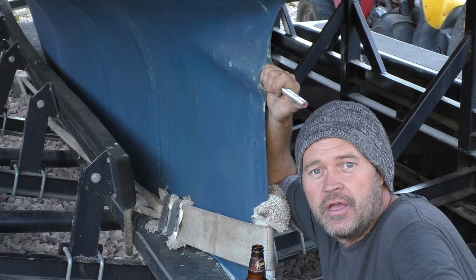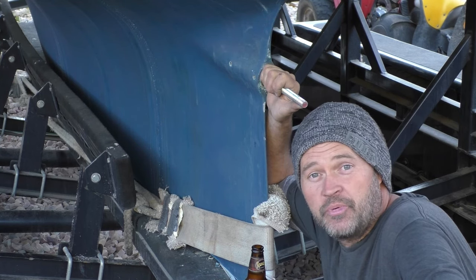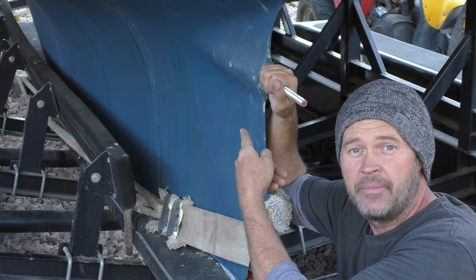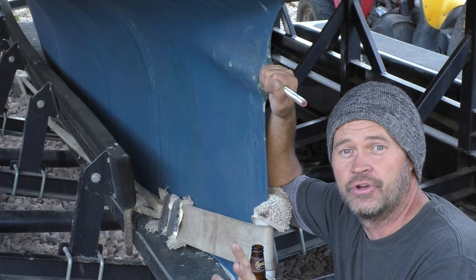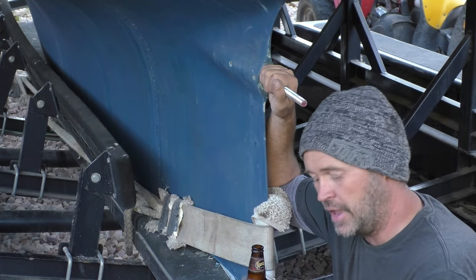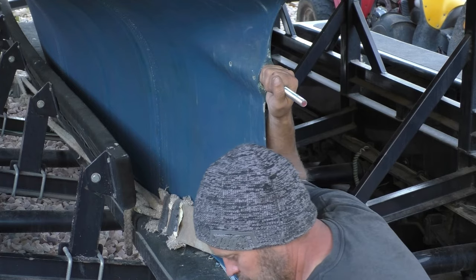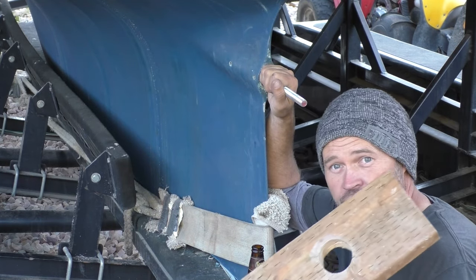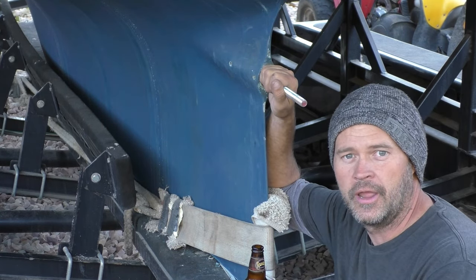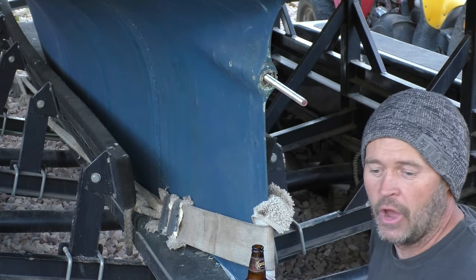So this is what I've come up with next — I'm going to build a press. I've got this piece of all-thread on a pipe; it goes through the sides of the bearing, clear through the stern tube. Some washers on the end — I'm going to try to press this thing out, pull it out. I'm going to drill holes in some blocks, use washers and nuts, put a socket on it, and see what we can do.